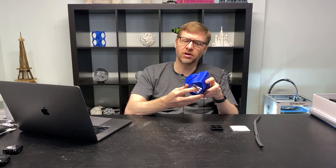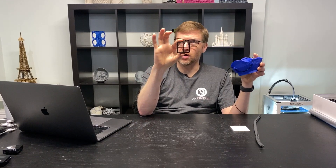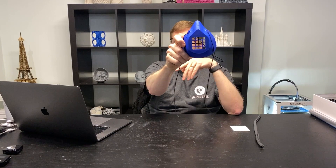The other change we made was adding a protective grid on the front face of the mask. That came from discussion with several of the medical professionals in our group, who explained that when these are being used in a hospital or surgery room environment, there's a lot of hands moving around and it's not hard for somebody to hit the front of a mask and potentially push the filter through from the outside. So we wanted a protective mechanism to prevent the filter from being pushed through. The filter frame insert piece that goes on the inside has a cross grid pattern, and the grid on the mask itself complements that so when these are put together, that grid pattern provides reinforcement for the filter from both sides, while minimizing the amount of filter surface area that is covered up.